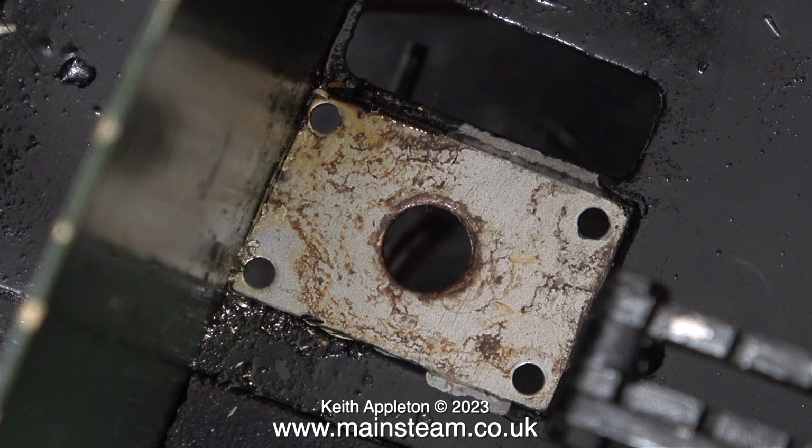By drilling a hole next to the main hole in the centre, then turning the hole into a big slot to match the centre hole, it will then be possible to remove and reinstall the pump at any time without having to mess about with dismantling the banjo union. This will be a job well worth doing. But that's it for now.